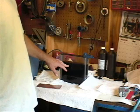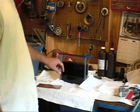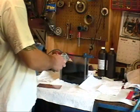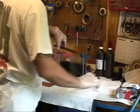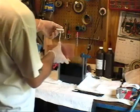Right now we're waiting for the ferric chloride to get up to about 120 degrees. I go with between 115 and 120. We're only at 90 right now. Our etchant is now at 115 degrees — we're ready to go. The board is set in the holes.